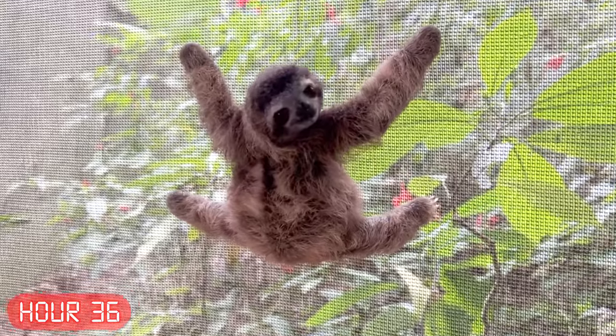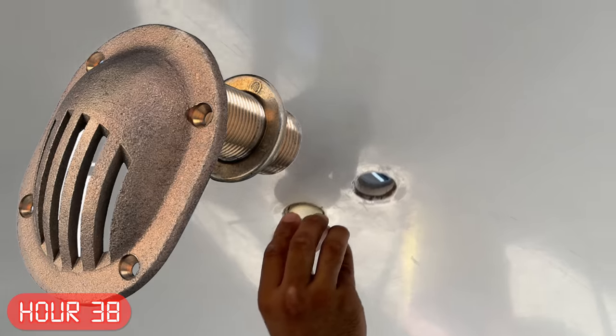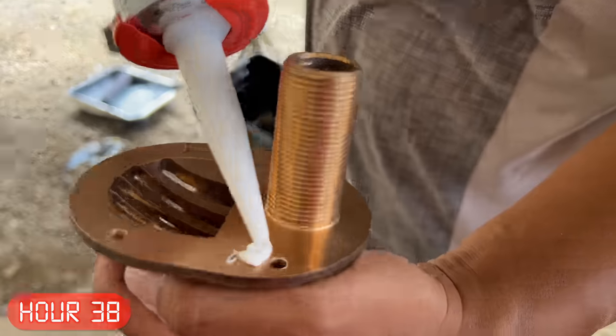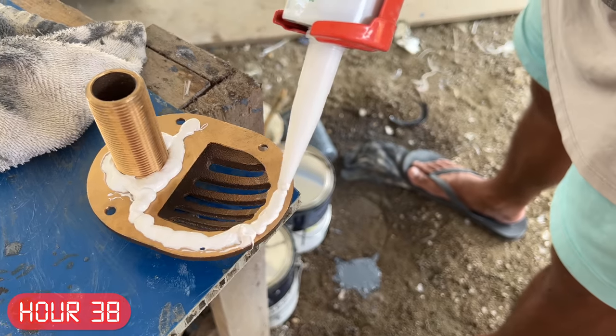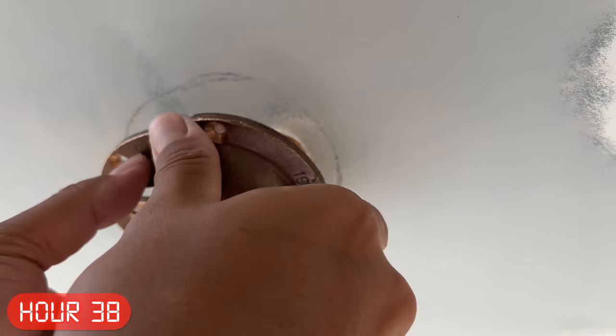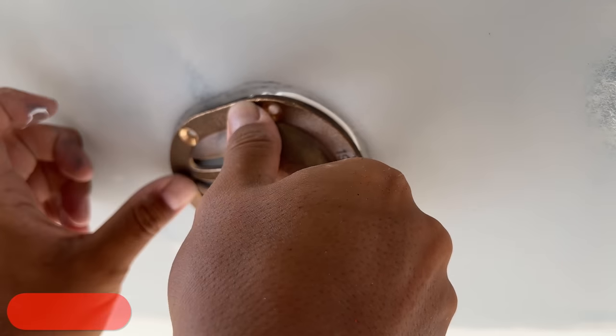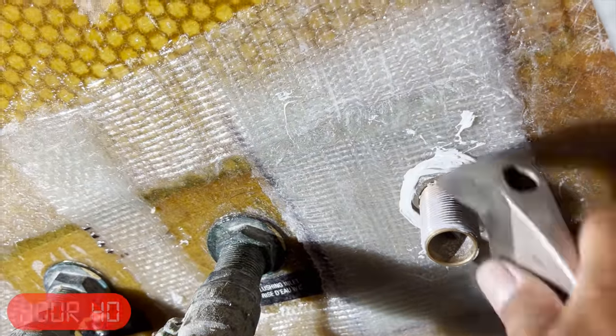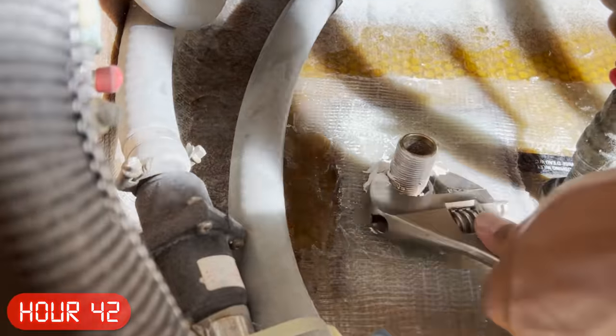We made a pit stop to see some Panamanian fauna — we got to see a sloth! And came home with a through hull with grates, and also some plastic ones since we broke them when fiberglassing the sun pad. I'm definitely getting better with the caulk gun. Apparently the grates prevent cavitation — bubbles — so you can use the water maker while sailing. We also added some extra fiberglass to this area since there were three holes so close together.